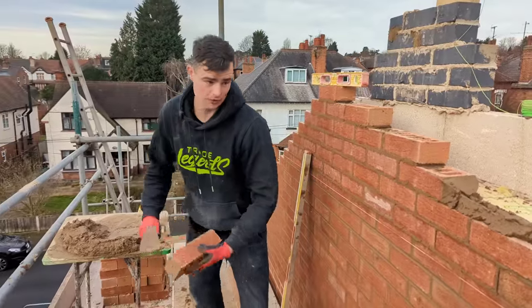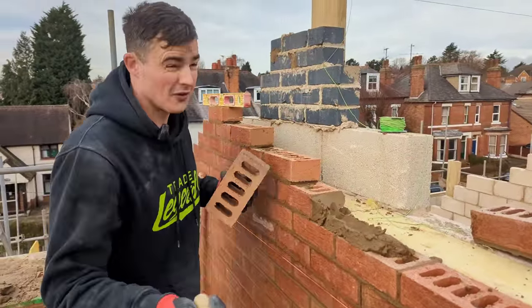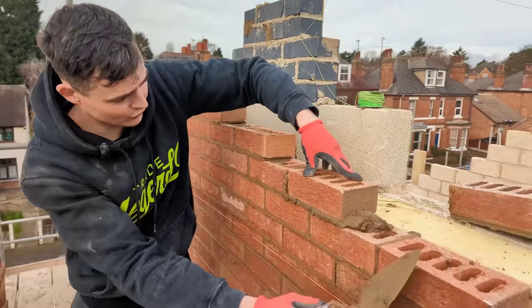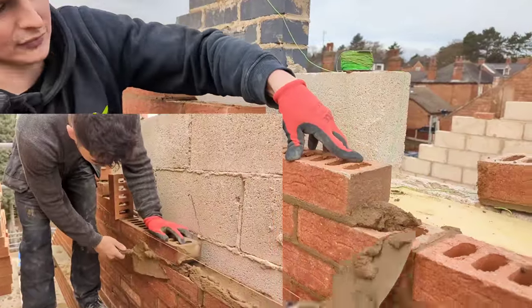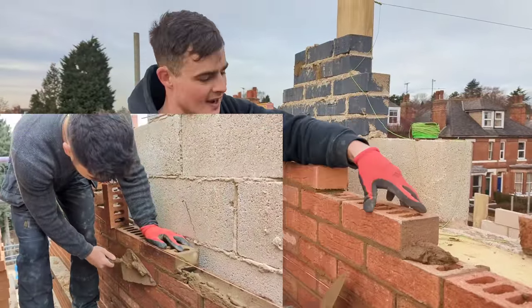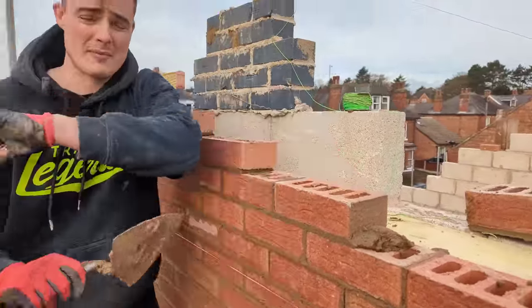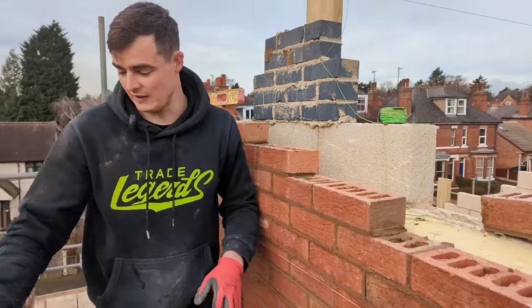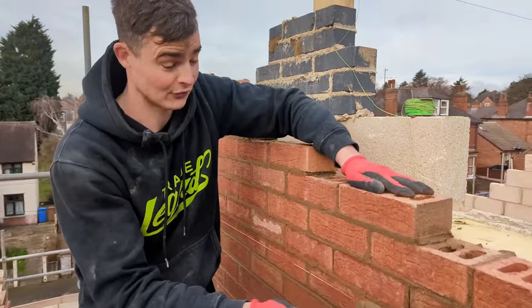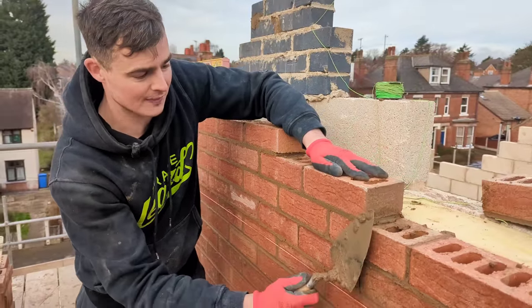Right, yesterday, while looking at your footage, Drew, and this goes for a lot of apprentices, I noticed it yesterday while you was doing it. When you're putting the brick down, you were scraping. You were doing about 6 scrapes per brick, okay? Ideally, when you put a brick down, 1 scrape, 2 scrape, maximum, okay? Because you're going to waste so much time scraping. Your brick's already down, and I know it's correct because I saw, okay?